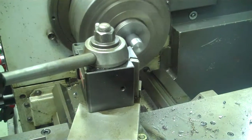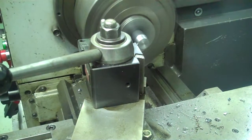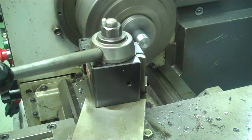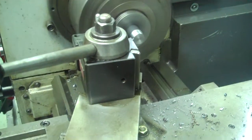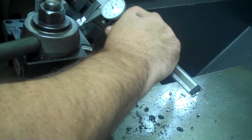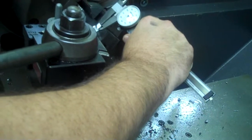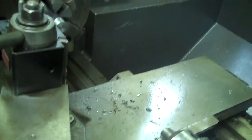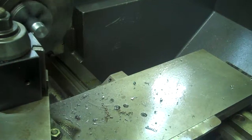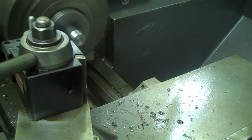The whole part has to be 312 thousandths long. So once I get beyond the 312 thousandths section, I can stop and I'll use my parting off tool to part it off after. I just touched right there — I should have about 120 thousandths. It looks like I'm not quite at 120 thousandths; I need to move out a little bit. I think that's because of the radius on my tool — I've got about a 30 thousandths radius, so I'm going to account for that and move out to about 150.